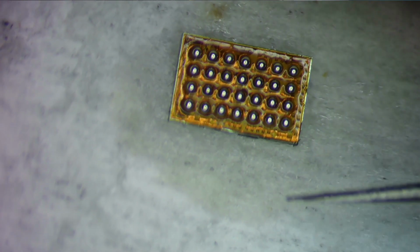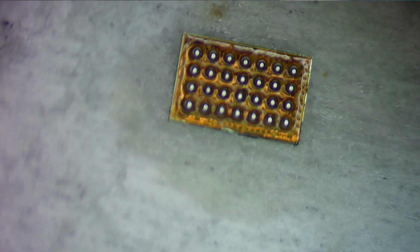And I didn't have a stencil the exact size. I tried to find one similar in another type of stencil, like an iPhone stencil, but no luck there. So I modified the stencil that I had for the other Max IC. I modified it to fit the chip with some Kapton tape. I will make a separate video on solder masking the damage to the other chip. I noticed it has a chunk taken out of it too, so it'll just be for demonstration and teaching purposes to show you guys how to solder mask that stuff.